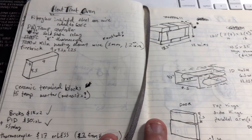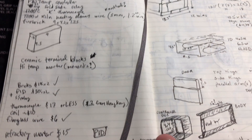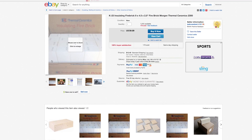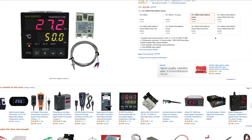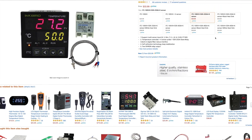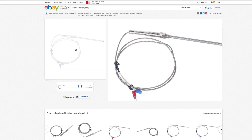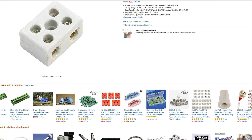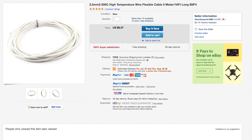I came up with the design and that told me what parts I needed to get, since most of them needed to be ordered specially. The whole oven is built out of fire bricks — they insulate very well and they'll take high temperatures. The brain is this PID temperature controller. It uses one of these K-type thermocouples and then turns on the heating element through a series of relays, all connected with ceramic terminal blocks and some high temperature wire.